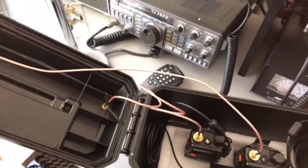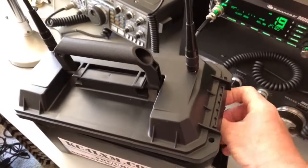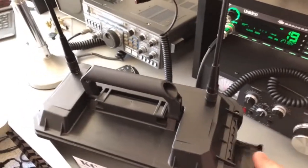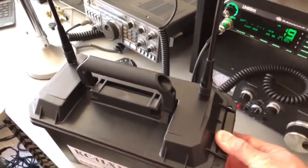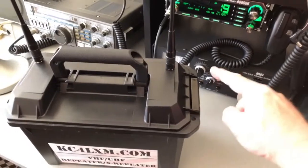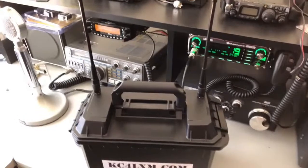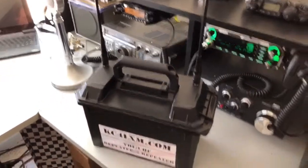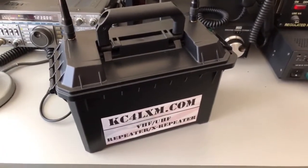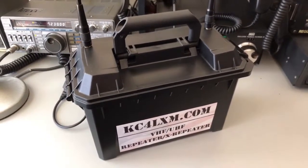You need to consider what's legal in the area that you're operating it as far as power and frequency. Other than that, you're good to go. All you do then is just shut the lid. This ammo can is actually watertight — I didn't put any sealant around my antennas, but if you did you could basically make it watertight. You can even lock it up — it's got a couple of lock holes so you can secure it somewhere. Take it up to a high spot or hang it in a tree. VHF, UHF, mobile repeater, crossband repeater — simple, inexpensive, and it works.